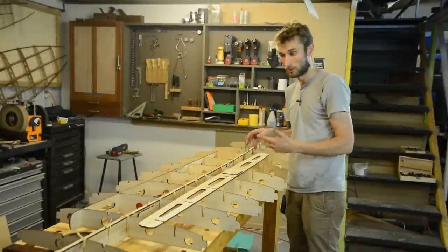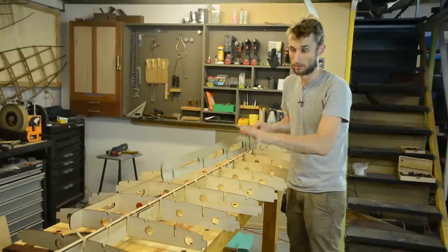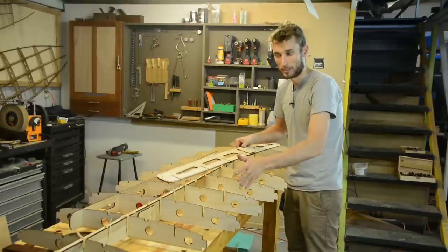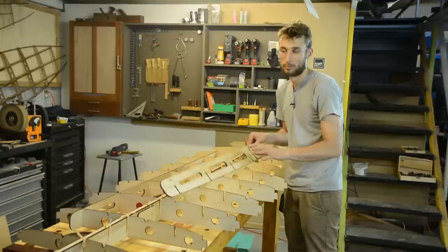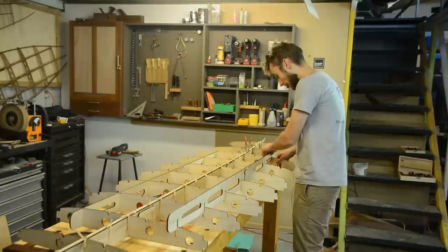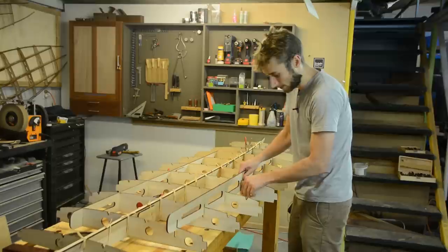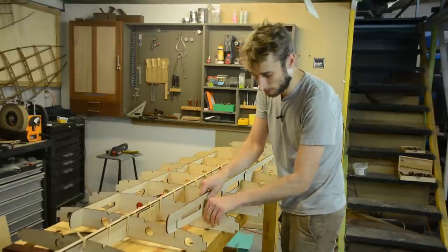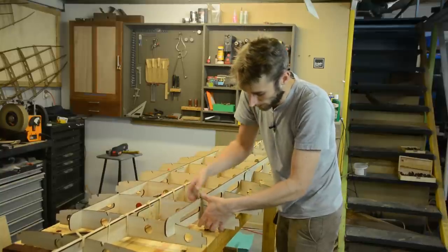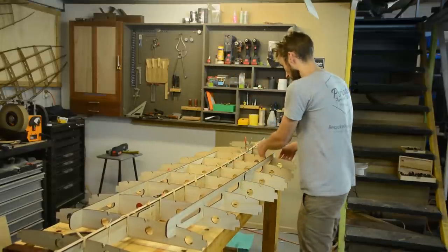With the ribs and spine stiffener installed, it's a good idea to do a dry install — no glue — of the side spines. The reason is it will bring everything that is out of square into square, and it will help with alignment when it comes to gluing them in place. The install can be a little bit tricky — you'll have to move up and down the board getting a little bit inserted at a time, without pressing so hard that you're forcing anything. We're just trying to get everything to line up nicely so it will insert.